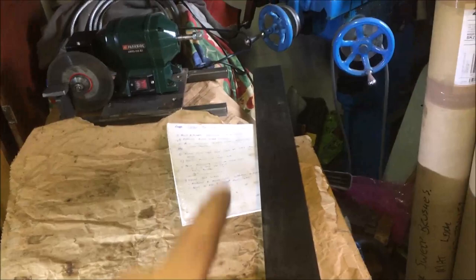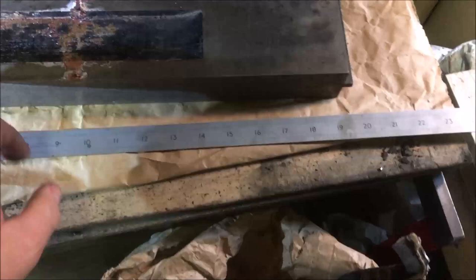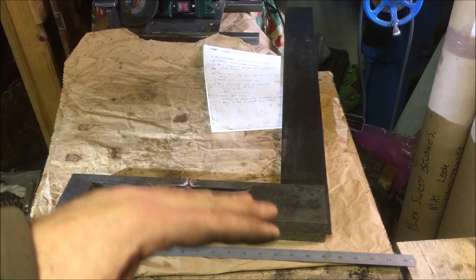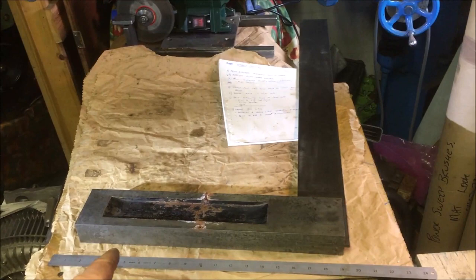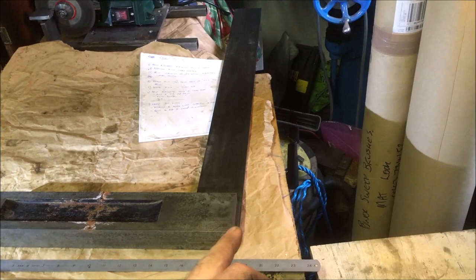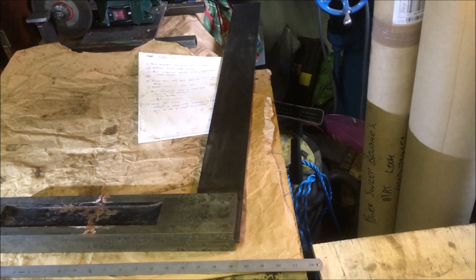It's three feet along the beam and 18 inches along the stock. It's had a bit of water damage — I knew that when I got it. I can't feel any significant dents, and at the moment I haven't been able to find any maker's mark. My plan is to get it cleaned up and then check with the base on the surface plate — I want to verify that face is at 90 degrees or determine how far out it is. I'm looking to use that outside face and get something in the region of no more than half a thou out at three feet.